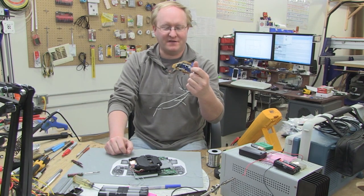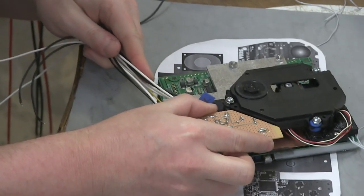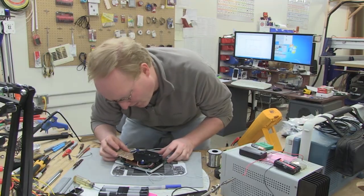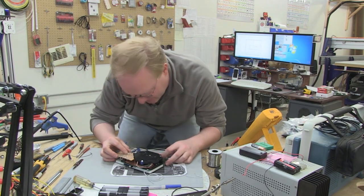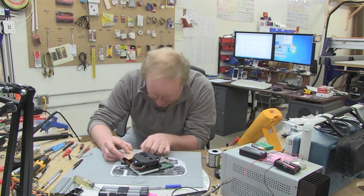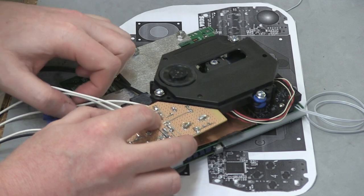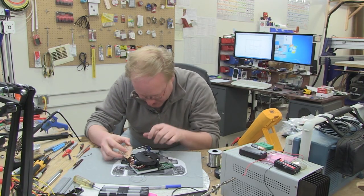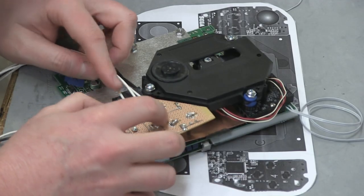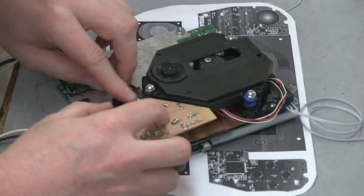This is a switching power supply that Felix redesigned and made into a shape that we knew would fit in the space we have. I'm going to nestle it right here just beside the CD drive and connect it to the motherboard. One thing I really can't stress enough is always take the thickness, shape, and bundling of your wires into account when you design something. How the components connect together is very important — that's usually with wires — so always leave ample room for wire wrangling.